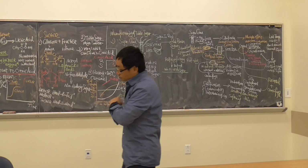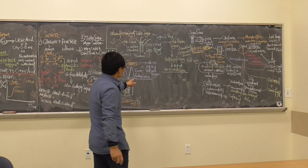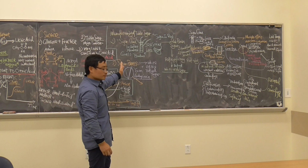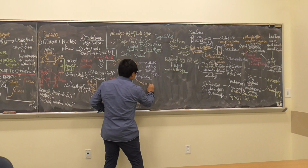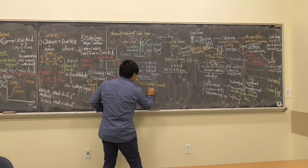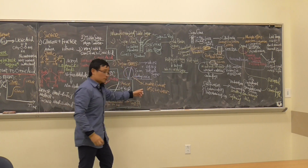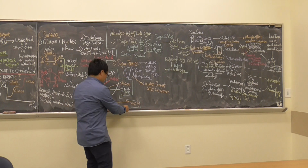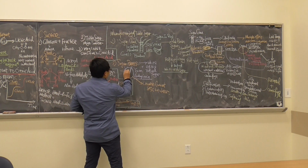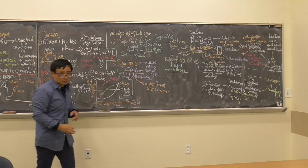Okay, so this is the process where we use sugar cane. How are we going to do the sugar beets? We're going to go here. Sugar beets look like a yam. We cut them into V shapes. What we have to do is a countercurrent with 85 degrees Celsius hot water. This is the key, the countercurrent. What does countercurrent mean? The sugar beets are there, and the flow of water goes the opposite way, so every time you are facing clean water. That's called countercurrent.